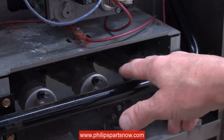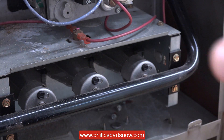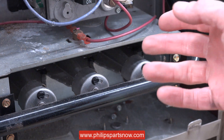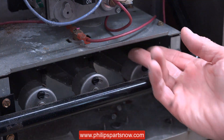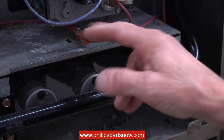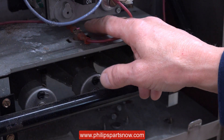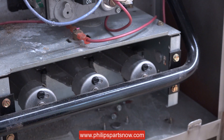The burners are right down here. When the flames are coming out of the burner, they should be going forward. If those flames are rolling back a little bit, they will start to lick this plate and heat it up. This plate will get hot and then this limit here will pop open, and you have a problem with the furnace that's not something you can just ignore.